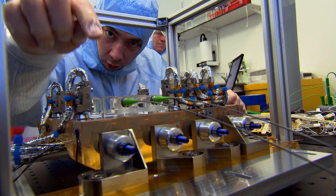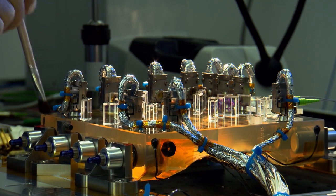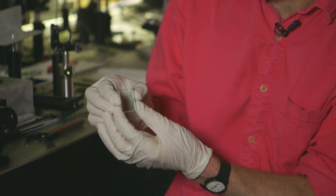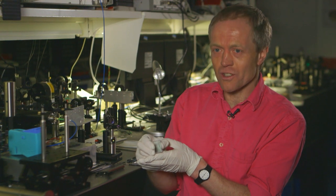The optical bench receives the laser light through optical fibres and then directs it via a series of mirrors and beam splitters to be reflected from the proof masses — the things that are floating inside the vacuum canisters. The beams are then recombined, and that measurement process called interferometry is what reveals, at a very sensitive level, the motion of the proof masses. This is an example of what one of these mirrors looks like — a beautifully machined piece of extremely pure fused silica. We have to be able to put this down and control its angle and position extremely well.